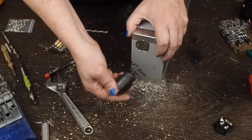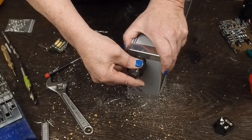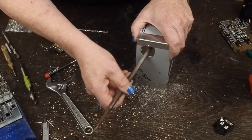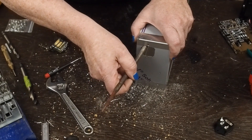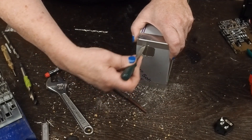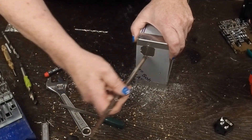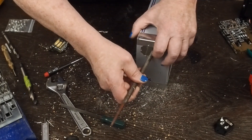You just use this same chassis punch and punch this hole out - as you can see it's a real close fit as far as the round size goes. Then I took my round file and went in this direction and this direction and then came back with my flat file and filed these flat parts like that - though that area could actually use a little more to get it nice and flat. Then you go in this direction to get these two further parts out and just kind of square off these bottom corners.